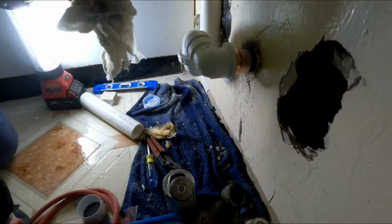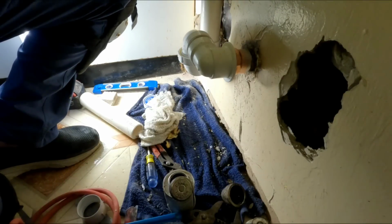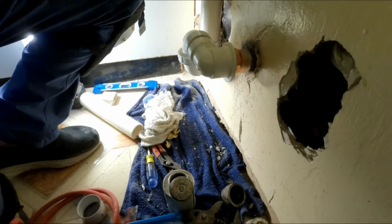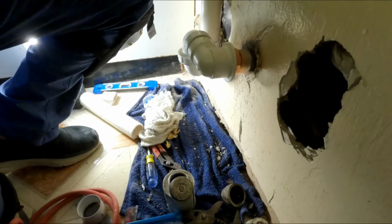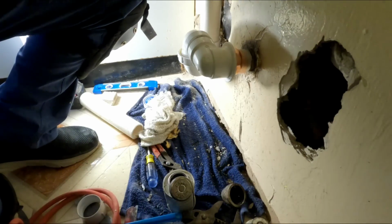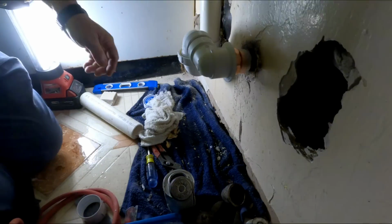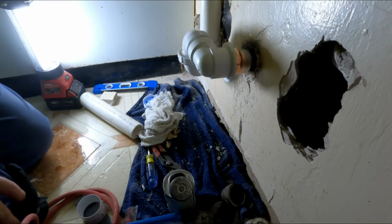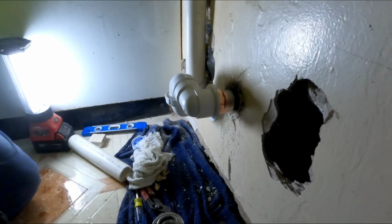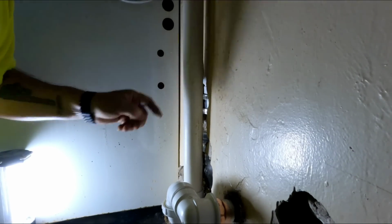All right, so we're done here. I got my clean out. Got the washing machine done. Now I just need to get some water running through here and see what happens. Get my cable. What I'm going to do is strap that first. I'm gonna put a washer hose down this standpipe, get some water running, and use my sewer machine up here in this clean out while the water's running, and that'll let me know when I got it cleared. So that's the plan.